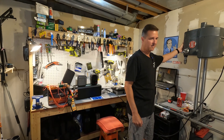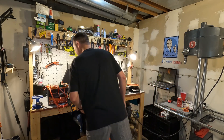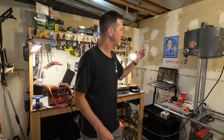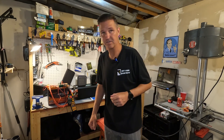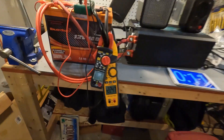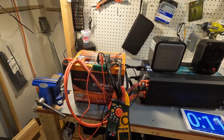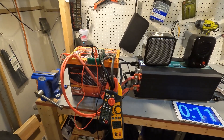Three, two, one — it didn't even register and the battery dropped to two volts, so the battery shut off rather than the inverter. I woke the battery back up — now at 13.34 volts — and tried again with just the ShopSmith plugged in. It captured 224 amps before shutting off, but it was only a half second to a second, not the claimed three to five seconds. So the surge performance isn't quite doing what was hoped.